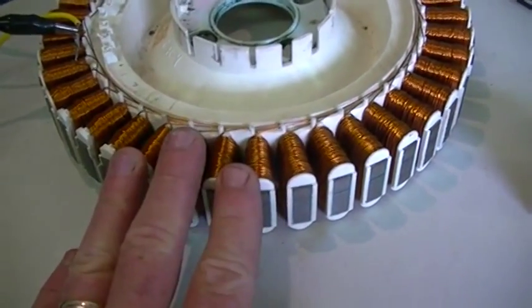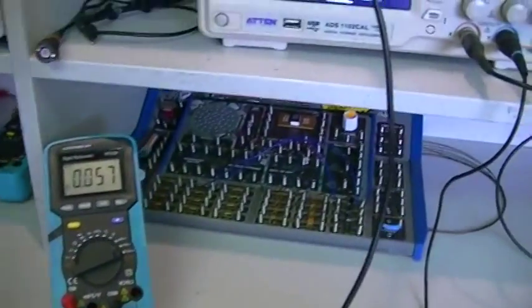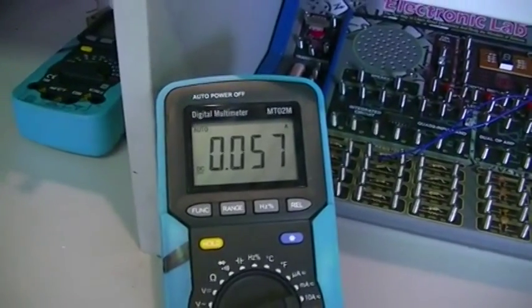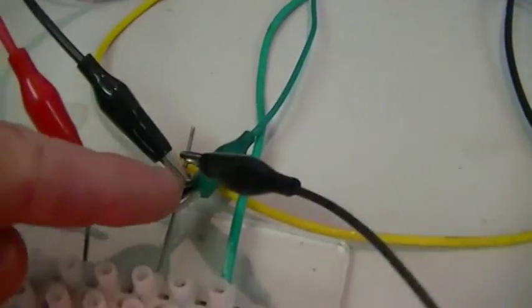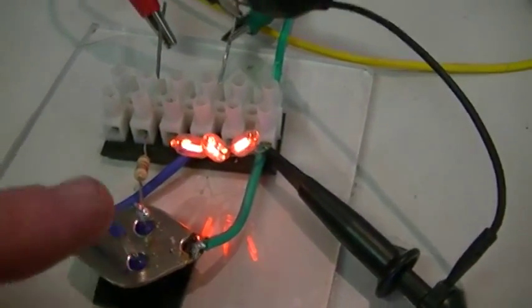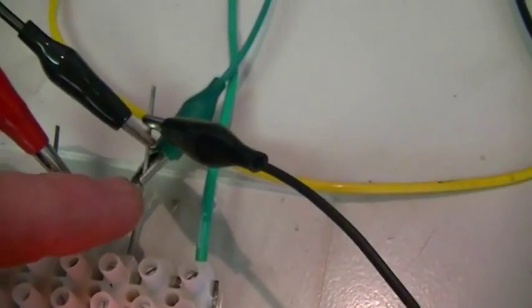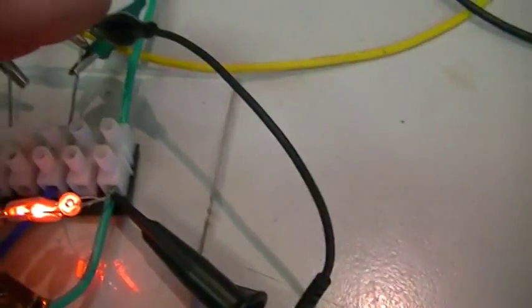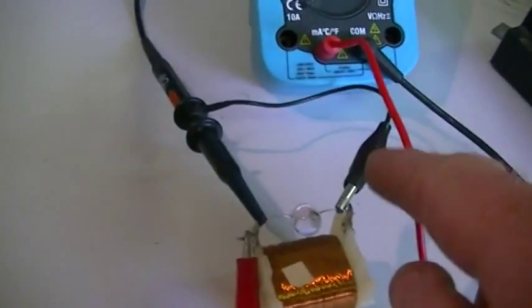And there are a couple of interesting things. I'll be back shortly. Okay, it's all hooked back up. So we'll run through the system and you can see what's going on here. Our power supply is set at 12 volts, about 58 mA. Our meter is saying 57, so pretty close. The ground is going to this pin here, which goes to the emitter. So the power supply ground, which is that green one, connected to the black lead, is going to the emitter. Our signal generator ground is also going to the emitter. Our scope probe ground is also going to the emitter.